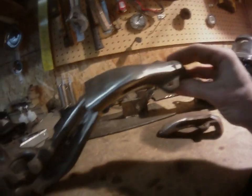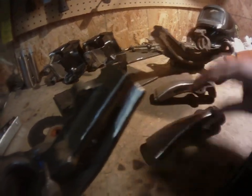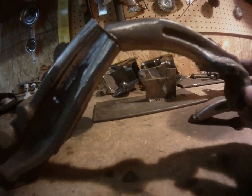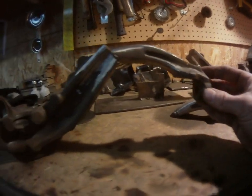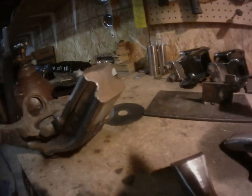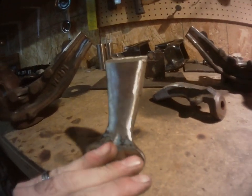They're also shaved smooth, because in case, for whatever reason, they did hit the bag, it's rubbing on something nice and smooth, and you don't got these little bumps and all that going on. So that's what we're going for with these, and that way he can have his upper control arm flatter, have more room for bags, compensate for camber by putting it forward, and then from there, he'll be able to pull in his camber kits to dial it in, get his fitment right. Yep, that's the plan. So now that we got these sitting flat, we just got to go ahead and do a four-sided bevel all around these and make sure they fit up, make sure they're even, which at the moment they are. Yeah, I'll go to town with the grinder and show you what we got.